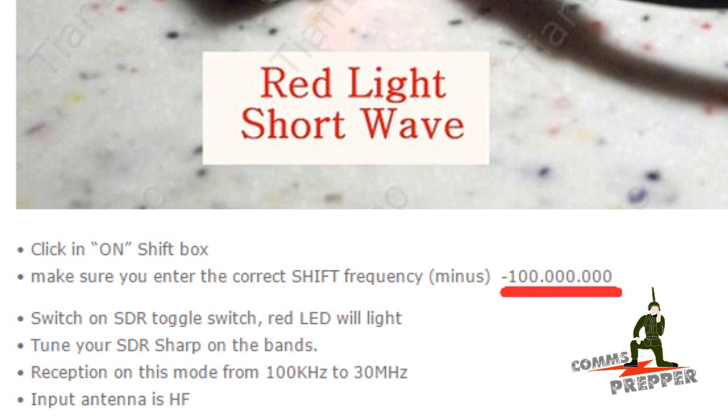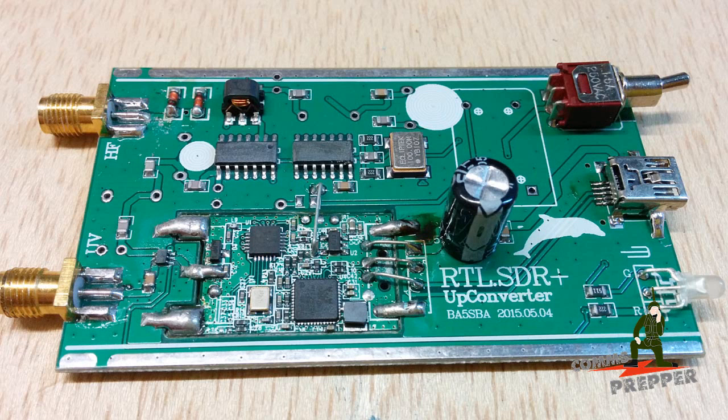So which is it — 40 MHz or 100 MHz? When you've got a lot of things to play around with trying to set up the software, you want to bring down the number of variables. We can just look at the board directly and figure out what the local oscillator is. Here's a picture of the board. I want to point out a couple of items on it for background's sake. We're looking at the top of the board; here's the bottom — not very much going on on that side.